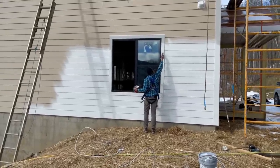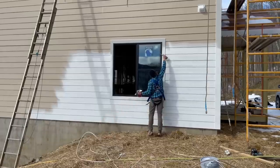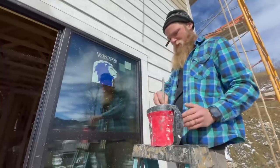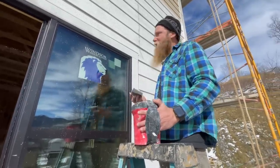It's starting to look like a farmhouse now that it's got white paint going on. Ray is hitting some heavy spots with a brush and feathering them out. What's really allowing us to mostly just spray is the fact we're using flat paint. These old farmhouses don't look shiny because it's old paint on old wood siding — we don't want this thing to look shiny when it's done. White doesn't fade very easily so we're okay using it. It is wood grain siding, not a smooth surface, so that's also allowing us to not be as meticulous about paint coverage being 100% equal everywhere.